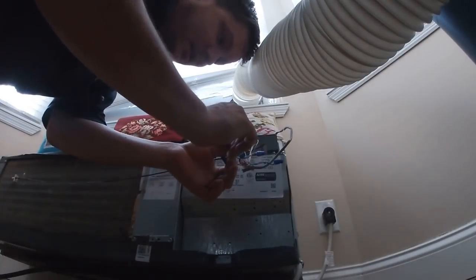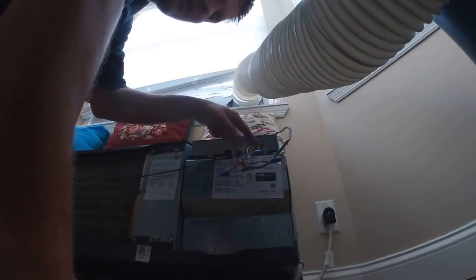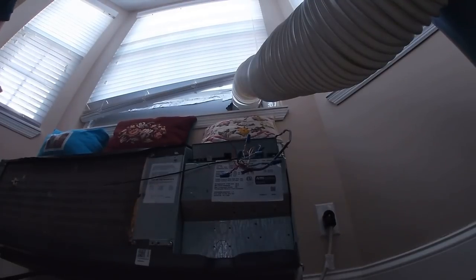OB needs to go to orange — that's the thing. Blue is common on here, but somebody put in a blue wire from the pigtail and connected it to the orange wire, so that's the problem. Not everybody does wiring the way you would. This unit has a five-minute lockout. The other empty socket is for fan high speed, but we keep it on low to keep it quiet. The compressor is coming on and then cutting right back off.